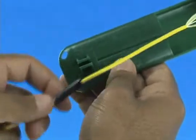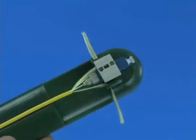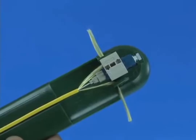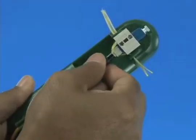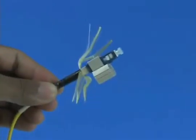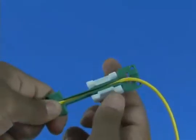Remove the cable from the assembly tool cable grip. Slide the boot up the cable toward the connector and past the assembly tool cable grip. Straighten out the cable and return it to the cable grip. Divide the Kevlar strands into two equal bundles. Place the Kevlar bundles into the assembly tool Kevlar grips on each side of the connector. Tug the Kevlar lightly to ensure it's pulled taut and the 900 micron buffered fiber is not bent. Screw the boot onto the back of the connector to fix the Kevlar. Remove the connector from the assembly tool, then remove the wedge clip unit. Trim the excess Kevlar strands using Kevlar scissors. Release and remove the cable clamp. Termination is complete.